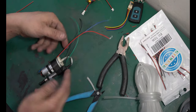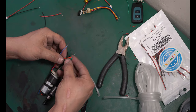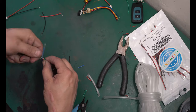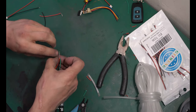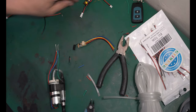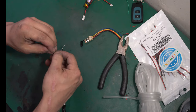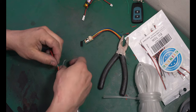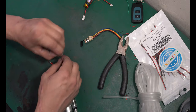Now we need to connect the positive and negatives from the vape and the air pump together. Wire the positives together because we only want the pump to come on when the vape's on and vice versa. And wire the negatives together. Now we can do a quick little systems check before we install the wireless receiver by taking our batteries and wiring it up real quick and dirty, just super temporary. Throw some tape over those connections if you don't trust yourself and don't want them to touch.